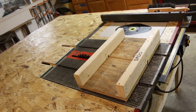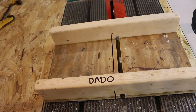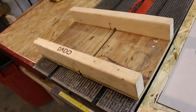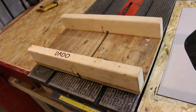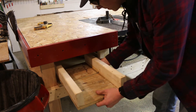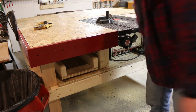There is the completed cross-cutting and dado sled. It's pretty down and dirty — nothing very special about this one. There's definitely a lot more I can do to improve something like this, but I just wanted something very simple that I could whip out and cut through a couple boards, make a couple joints whenever I need to. One of the reasons I made a thinner cross-cut sled is so that I could store it in my outfeed table next to the saw.